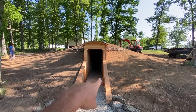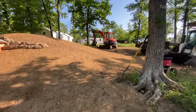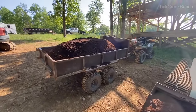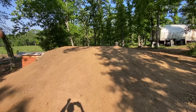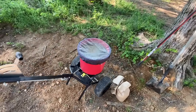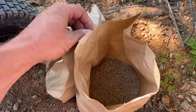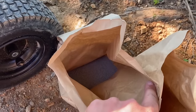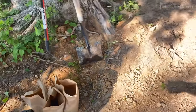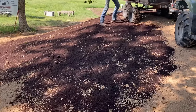Going into the entry, we still need to put the door on and a little trim. We've got retaining walls up at the top. We're going to spread a light coating of decomposed sawdust after we seed it, then unroll hay on top to help with erosion and keep the moisture in. We've got Kentucky 31 fescue, medium red clover, and crimson clover going down — very heavily overseeded, but that's all right.